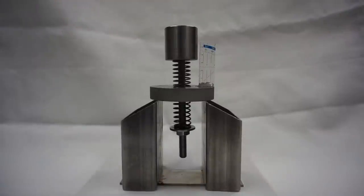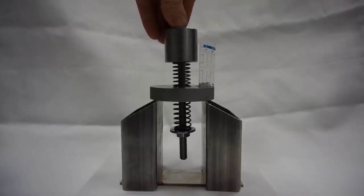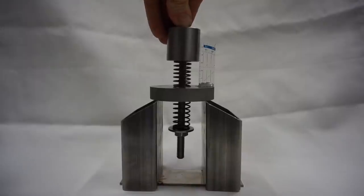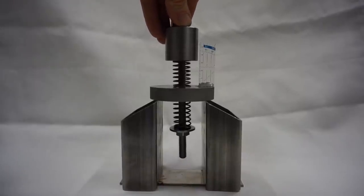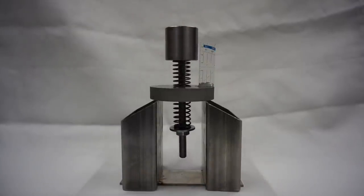But back to our case at hand. What happens here? And for this, keep an eye on the lower spring here, or the lower bearing. As I increase the load on the spindle, you see that it relaxes away from its preload state. So you could say, as we load the spindle, the preload relaxes. This way the spindle deflection is notably smaller, since with increasing the external load, the internal load decreases. And this causes higher spindle rigidity with bearing preload. Simple as that. And higher spindle rigidity is good. Infinite rigidity would be even better. But life is no wishing well, is it?